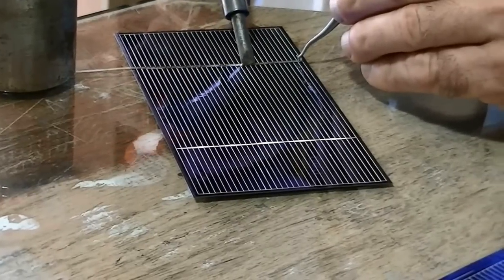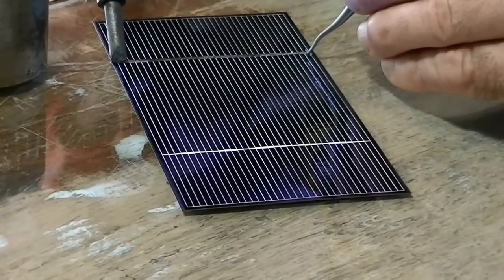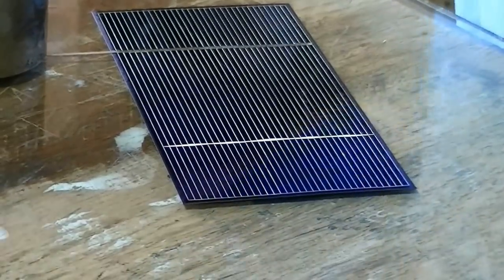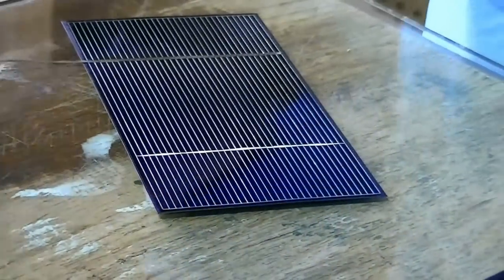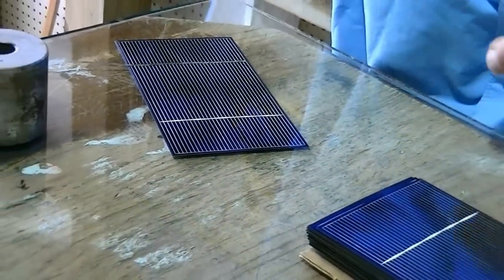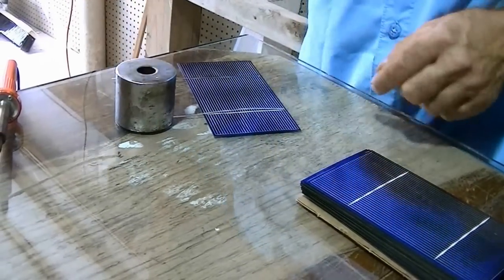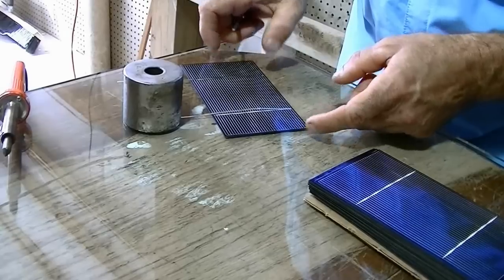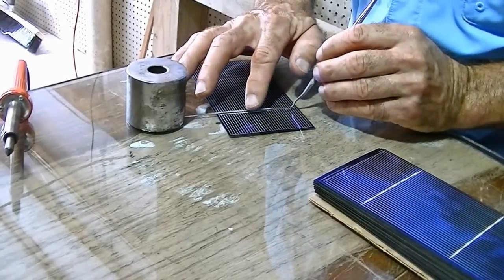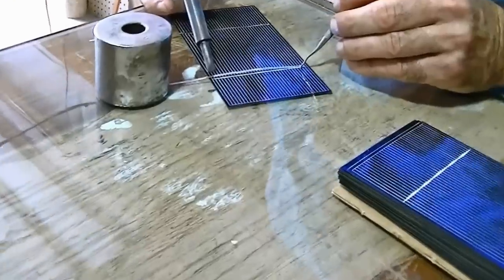You can see it getting shiny. You can't immediately go and solder the other side — you've got to give the soldering iron a chance to reheat that tip, and that's also critical. So really, by the time you get your next one in position, take your time, don't rush, hold it down again and we'll re-solder.